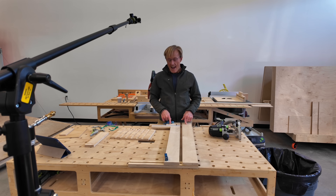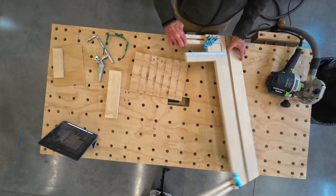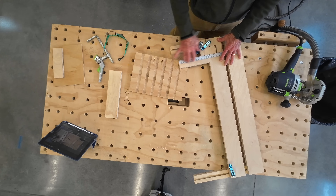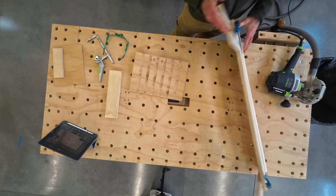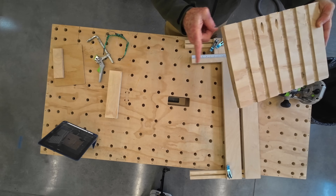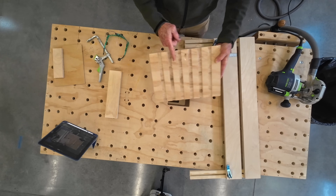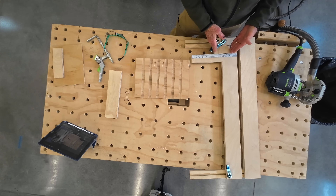The next little trick this jig has is the spacing. I have a block on here that's separately adjustable, that can move up and down this scale here, and it has a stop on it. That stop then goes up against the last cut. So I started on the bottom and then slipped it on to the next one, the next one, the next one, and I get this exact layout of whatever I set it for.